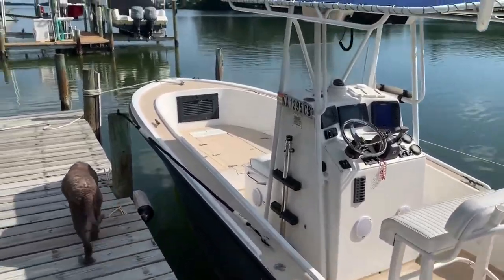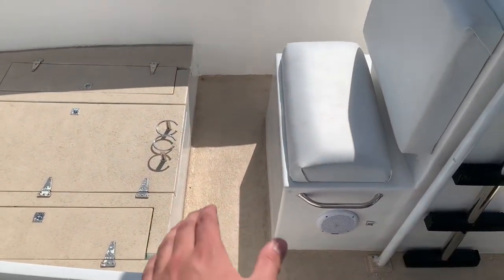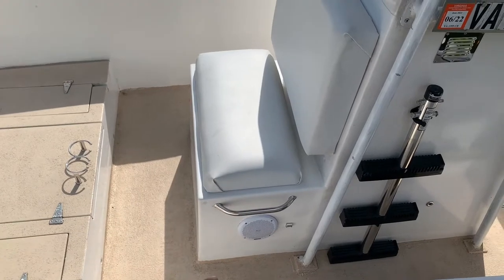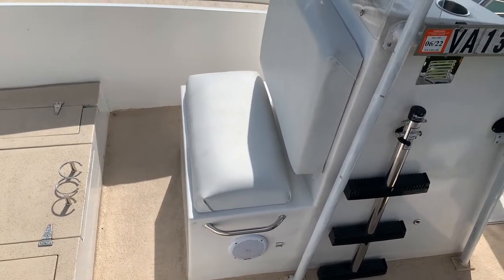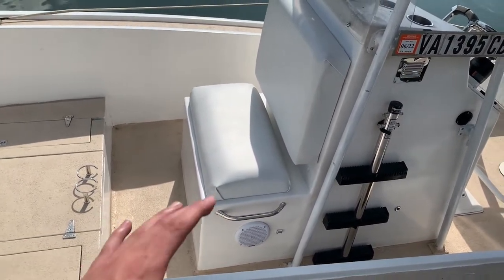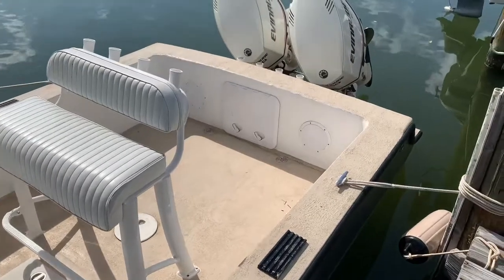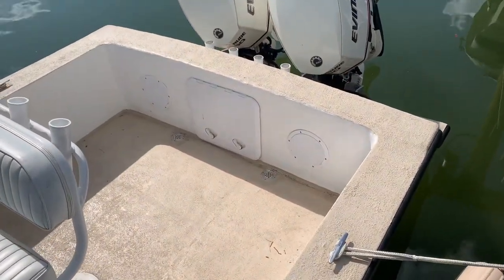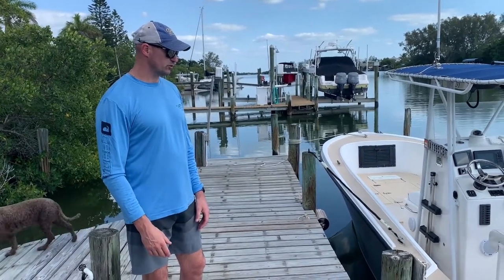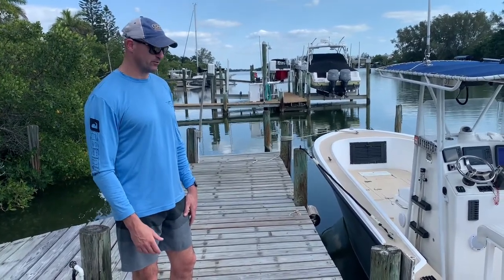We left this front deck piece right here. Everything beyond this point was not there when we got it, and so we redid that. There are three or four sheets of marine plywood that we crowned so water would roll to the edge to either side and then go to these two drains right there, go out of the boat between the engines. Like I said, it's about 3 years worth of work for us, and we did this in the backyard underneath tarps, a little bit at a time.